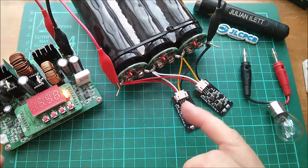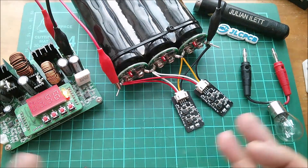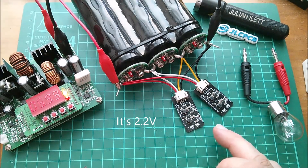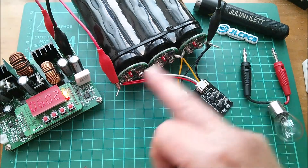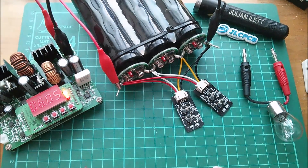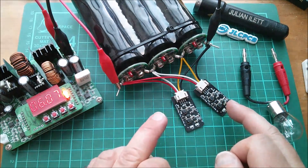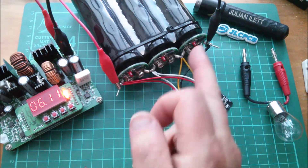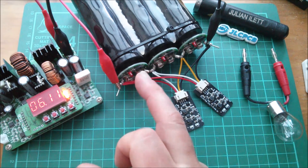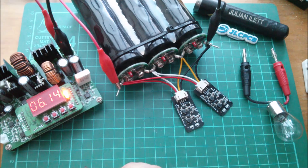The capacitor bank is up to six volts now — not a flicker from the balancers yet. They do have a minimum voltage. When these get to 2.5 volts per cell we'll have 7.5 volts across here, which is the maximum for these capacitors. Just sitting here waiting for the lights to start coming on, indicating these devices have detected a voltage imbalance and are trying to correct it. The red LEDs on these boards indicate over-voltage protection, coming on when cells reach 2.5 volts.